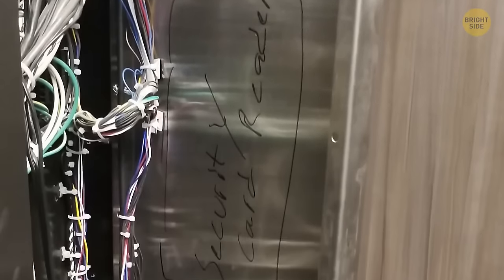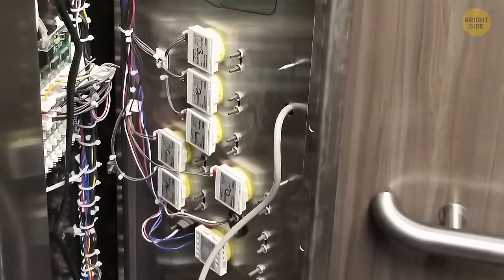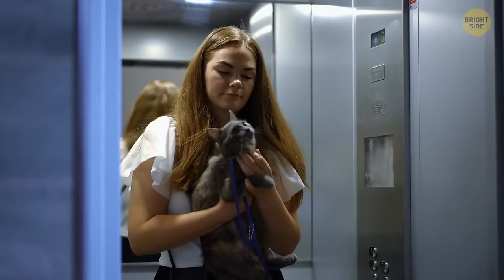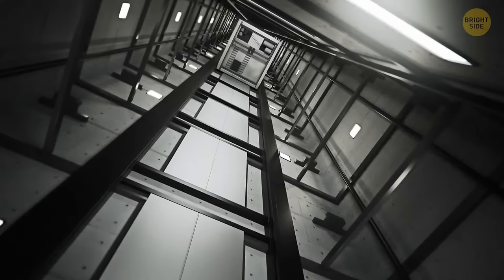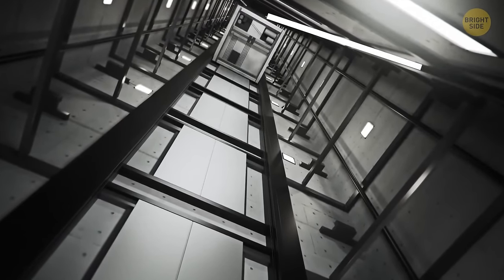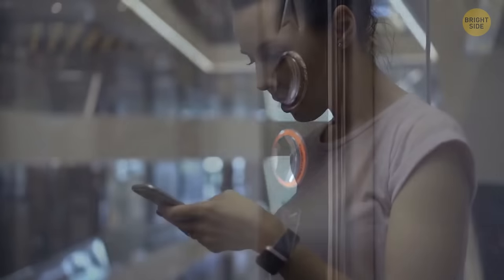This photo shows what's behind the elevator buttons — obviously, a bunch of cords. The buttons are all wired to a computer that manages the elevator. How does the computer know where the elevator is? The most common system uses a long vertical tape in the shaft with a series of holes. A sensor counts the number of holes passed, and that's how the location is determined.